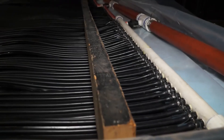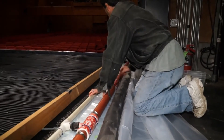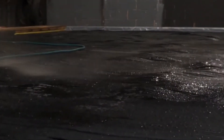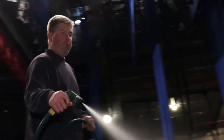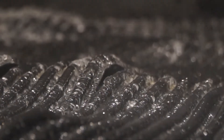As the glycol flows through the mats, the team checks for leaks. With the unit maintaining pressure, it's time to start making ice. You can't just fill it with water and wait for it to freeze — it would never happen. You actually water it with a garden hose, layer by layer. You water it, wait about 10 or 15 minutes, and the water you put down is now frozen. You water it again, wait 15 minutes, water it again, and it takes about 12 hours.